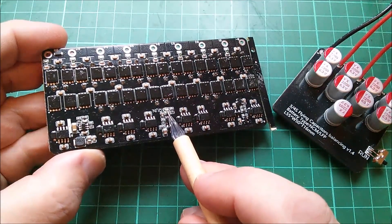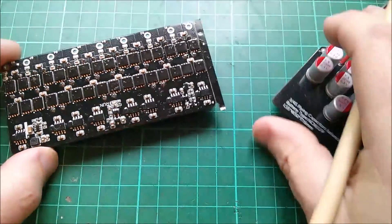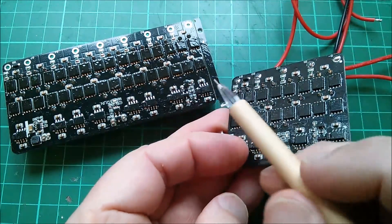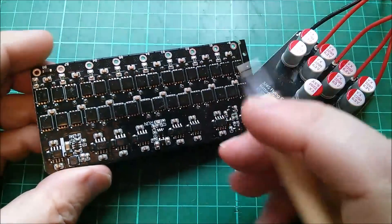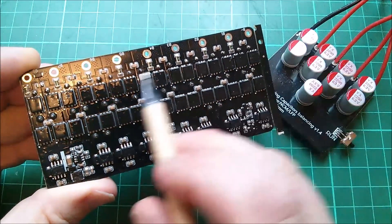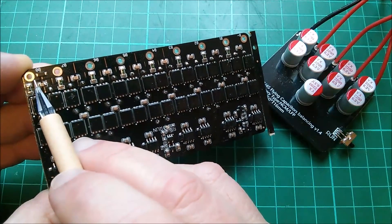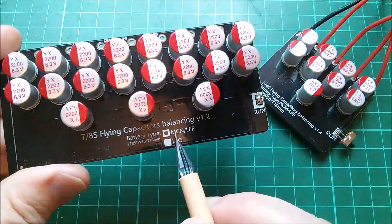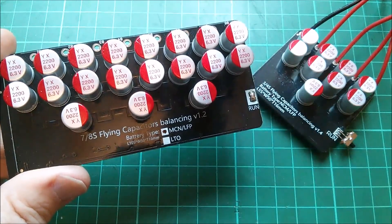You've got the controller chip there with the run LED, eight lots of MOSFET drivers I believe. The same three-transistor circuit is on this one as on this one — the layout is slightly different, three transistors are just positioned slightly differently. Are they the low voltage monitoring? I don't really know. But essentially it's the same. You've got all these polyfuses, you've got the diode linking positive of cell 7 to positive of cell 8 if you want to put this on a 7S pack, which is more common if you're using MCN. Eight cells is more common if you're using LFP because of the voltages involved.